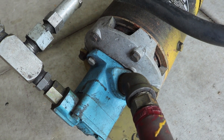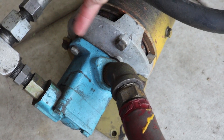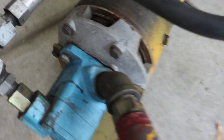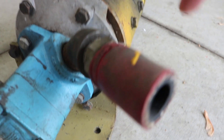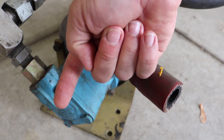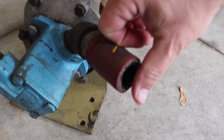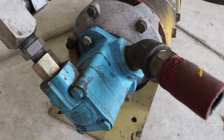In general, it's my understanding that pumps usually spin clockwise from the shaft end. So my first guess is that I need this pump motor to spin this direction. Probably the easiest way to test this is to take off these bolts so I can pull the pump motor off, check everything over on the motor, and make sure that this end is the suction end.